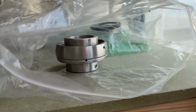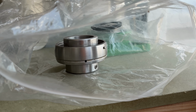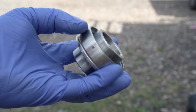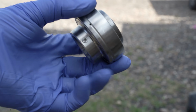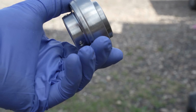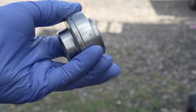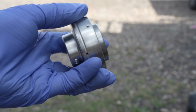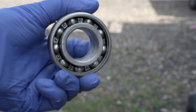Then, and yes, we awkwardly segue to the other bearing I decided to remove from the housing, we let that alcohol completely evaporate back in the workshop in a spot where nothing gritty could accidentally fall into the open chamber. Some of you might have been wondering about the grease refilling design for this bearing. Some have single holes so you need to line up perfectly with the housing's grease port, but this is more forgiving. There's a channel in the outer race that guides grease along to two little holes, thereafter into the bearing chamber itself. Anyhow, that dry, clean bearing needs re-greasing.